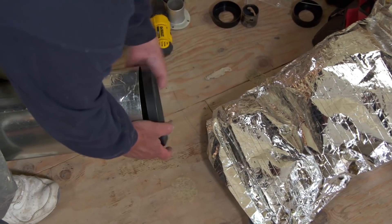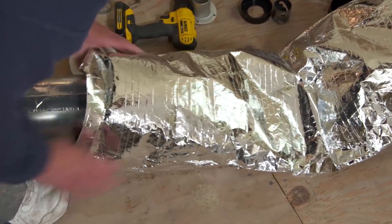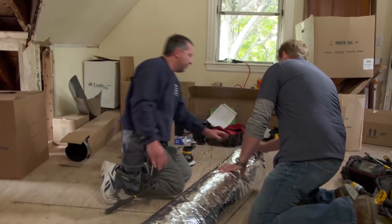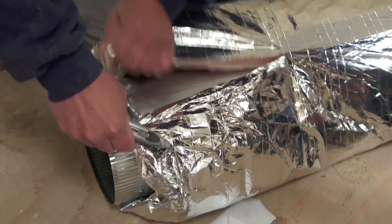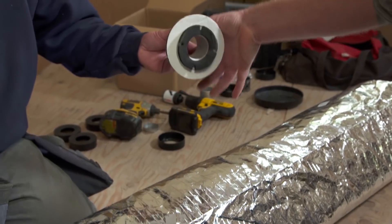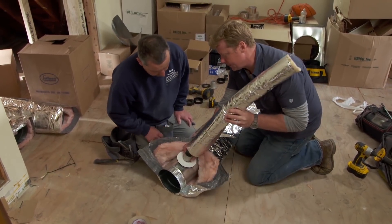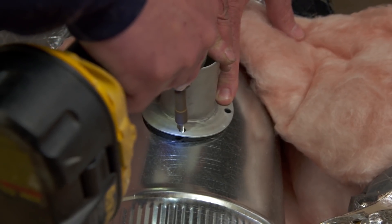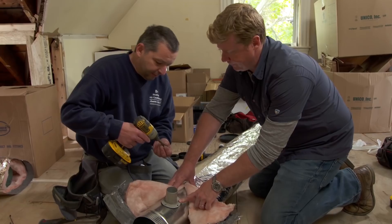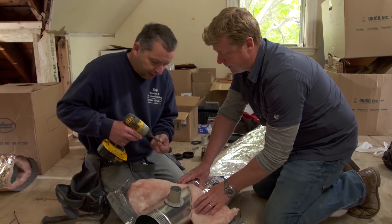Now we want to insulate it. There's a fiberglass piece of insulation and then a foil cover — just like the attenuator. We also have an attenuator to put in for that master bedroom supply line, and that can be done right out here. The saddle sets right down on the plenum — we screw it and drill it out. That's what connects the big trunk to the smaller attenuator run. Four screws hold it down, and we seal it with a little gasket to make a nice tight seal.